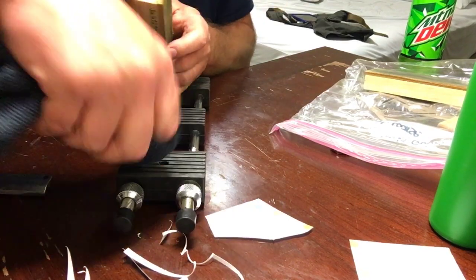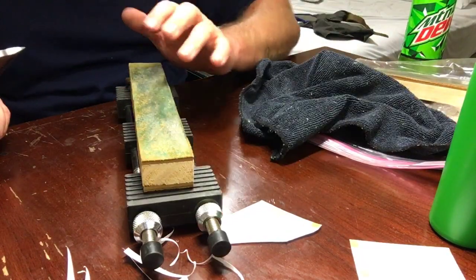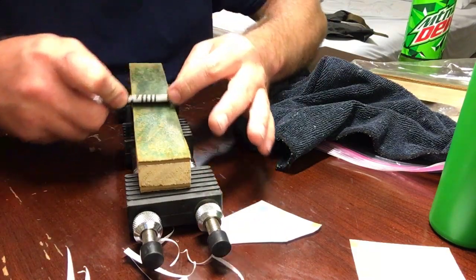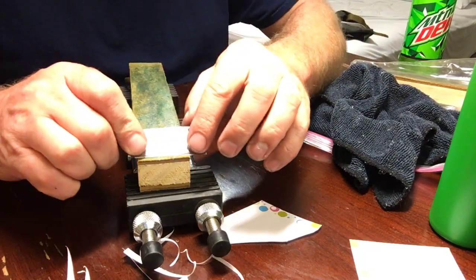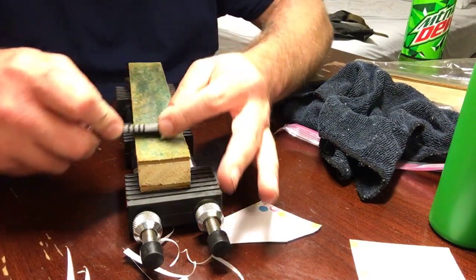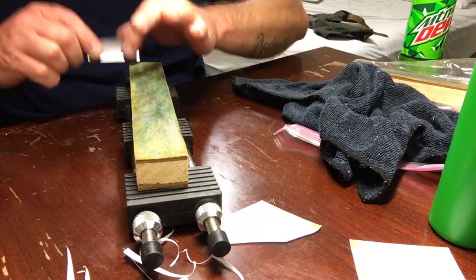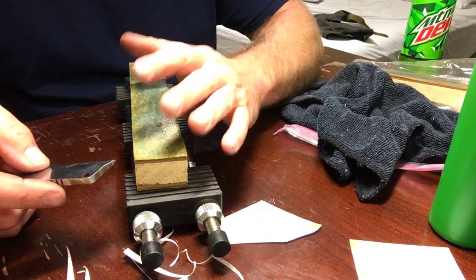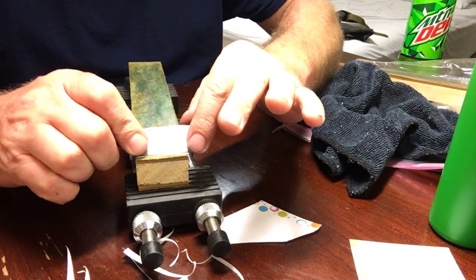Now, flip it over to our fine side. Now, the Pasagoy fine is the exact opposite of the other stuff. It's very slick. And this is actual honing compound. All three of these are. This is not buffing compound. I have learned that buffing compound has waxes or binding agents in addition to the actual abrasive that's in there. So you don't need that for honing. All you need is the abrasive to stick on here. It's not going to be spinning at a high speed. That's the reason the binders and the waxes are in the buffing compounds, to hold to that high speed wheel.